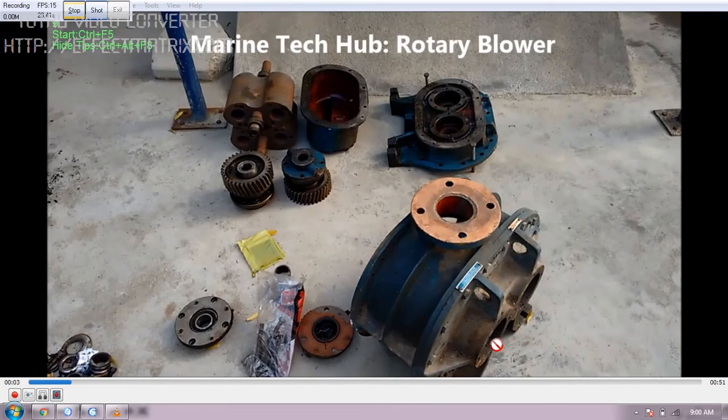We need 4 new bearings if you want to change them — 1, 2, 3, and 4. These are the things that should be rotating inside this globe. The clearance should be about 0.4mm. The gears will be coming on this side.